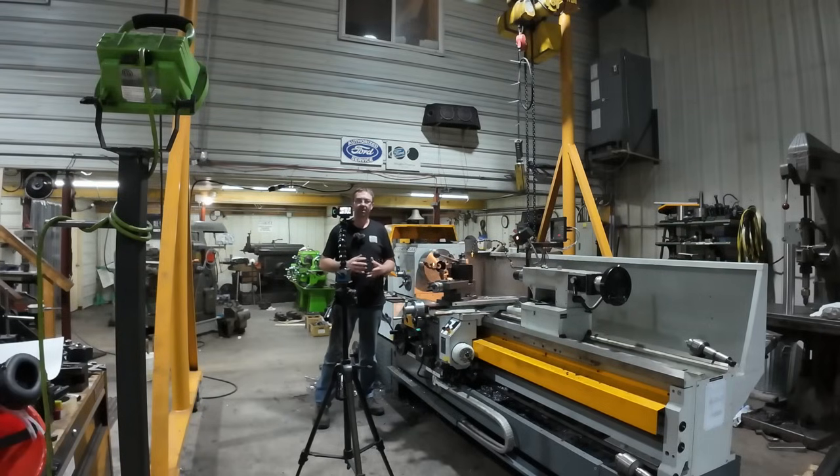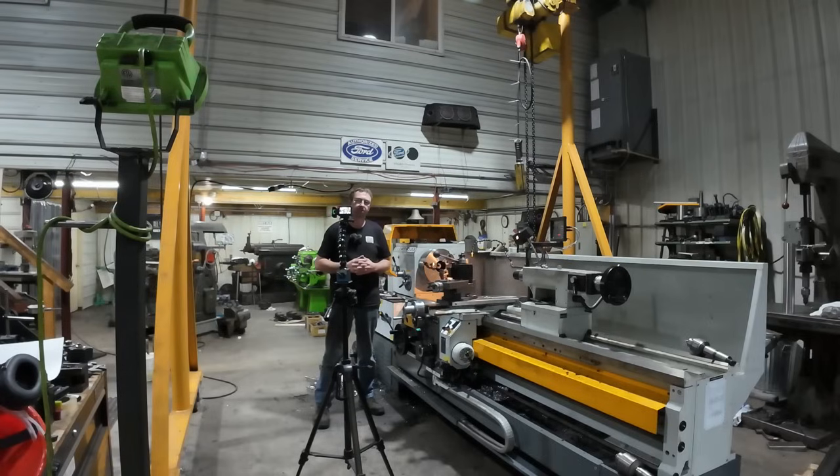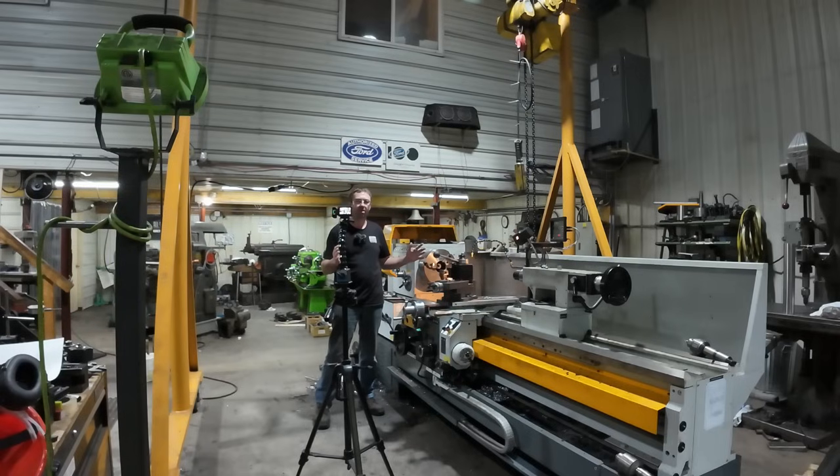I'm Josh Topper. In today's video, we are going to thread some big bolts. I've got some 2-inch round stock to turn into rock crusher bolts. We're going to be threading a 2-inch, 4.5 pitch by 24 inches long on one end, and then 2-inch 8 by 4.5 inches on the other end. So let's get started.